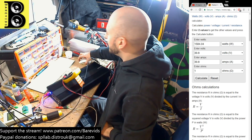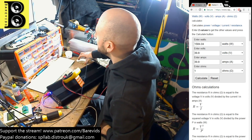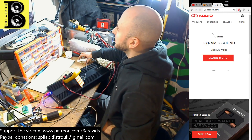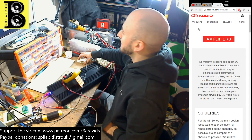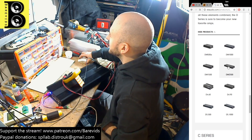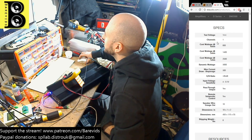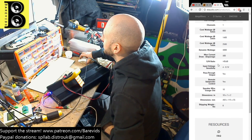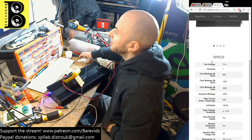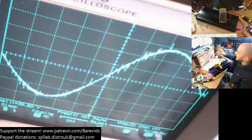Not too bad, but this amplifier is rated for 2.5k at 14.4 volts. If we look at the DD website — ddaudio.com — what THD is this rated at? Going to products, amplifiers, scrolling down to the DM series, DM2500... it gives test voltage, continuous wattage, dynamic wattage, signal to noise ratio, but DD are not listing the THD that this is tested at. I imagine this is probably tested at greater than 1% THD for 2.5k — probably around 5% THD perhaps. Our scope test here is less than 1% THD with no visible signs of a flat top to the wave and no visible clip.